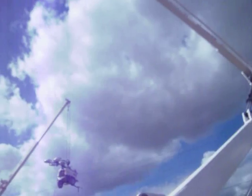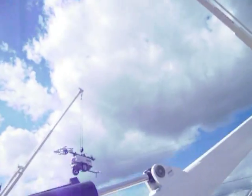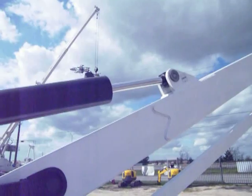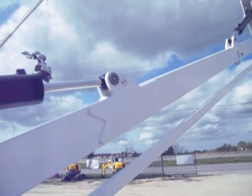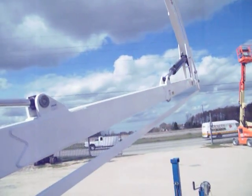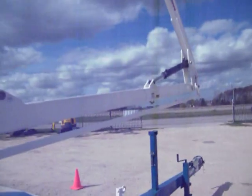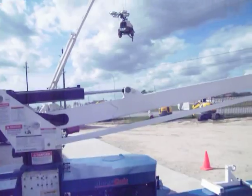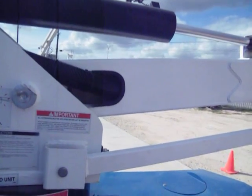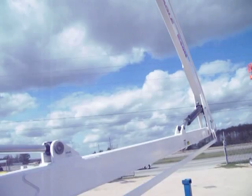As you can see now, not only do the limit switches stop the upper boom from going up, but once your upper boom is up at a certain angle and you start to bring your lower boom down, if your upper boom is too high your lower boom will stop automatically, keeping you out of the unsafe zone. To get back within the safe zone, you can bring your upper boom down, which will allow you to bring your lower boom down more into the safe zone.